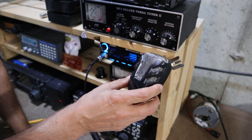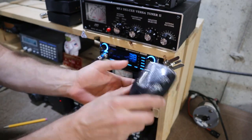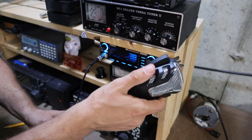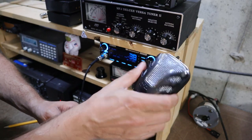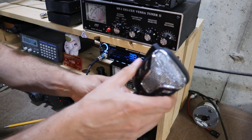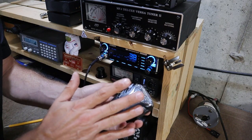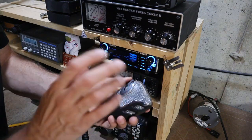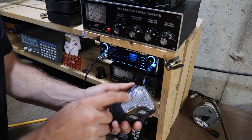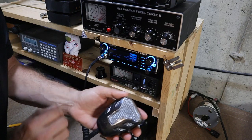Let's take a look at the microphone that came supplied with the radio. It looks kind of flashy with the chrome grill and chrome trim, and it is big — so if you had gloved hands you wouldn't have any trouble using it. But it does feel kind of light and maybe a little on the chintzy side. The cord actually feels pretty good — it's not too stiff and feels like decent quality wire. Just the microphone itself feels a little bit light. From the little bit of testing I did and based on some stuff I read online, there's a baffle or windscreen inside that blocks some of the voice power from getting to the microphone element. A lot of people open these up and remove it right away — I haven't done that yet but I probably will.